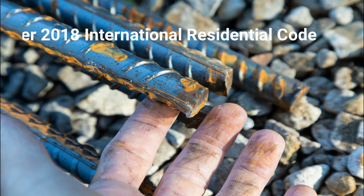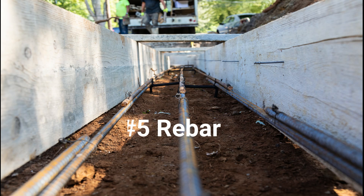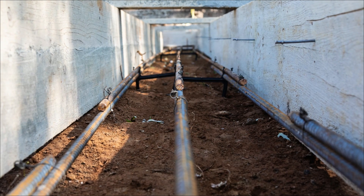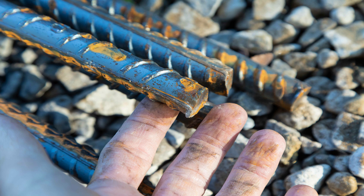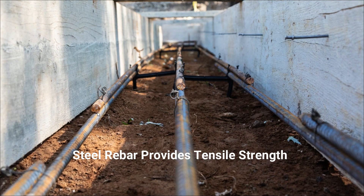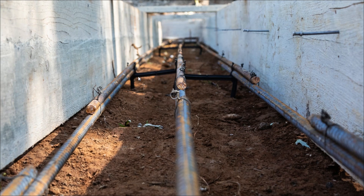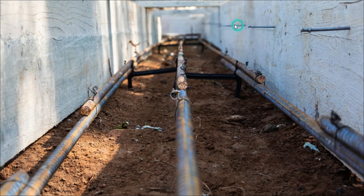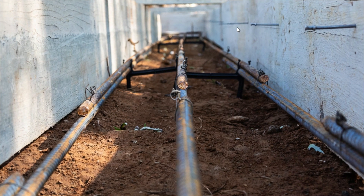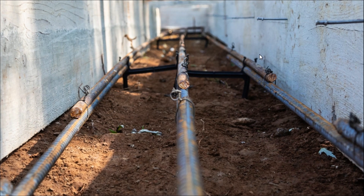We put three strands of rebar in the bottom of the footings to give support along the full length of the footing. You can see the three strands along the bottom of the footing forms before we pour. The lengths are tied where the ends of the rebar meet. See these ridges in the rebar? Those grab onto the concrete — if they were smooth, it wouldn't hold as well. The concrete goes around the rebar and latches onto those ridges for strength. These chairs hold the rebar two to three inches off the ground for maximum support. The nails show where the top of the footing needs to be poured to keep it level. We want to make sure this footing is level because everything above builds off of it — if the footing's level, the foundation wall will be level, and then the framing will be level.